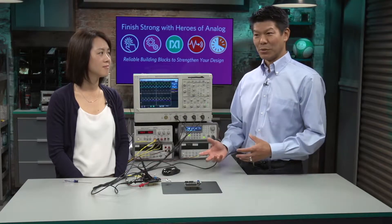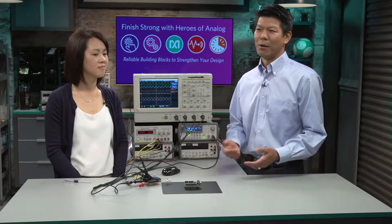It also has plus or minus 25 volts of common mode range, which comes in handy for applications where the ground planes are shifting relative to two different systems. This could be due to either operating from two different transformers, or there could be a large electrical noise source in between them that's bouncing that ground plane around. The MAX 13054A also has a standby pin, which is a multi-function pin, and we'll go into that demo a little bit later.